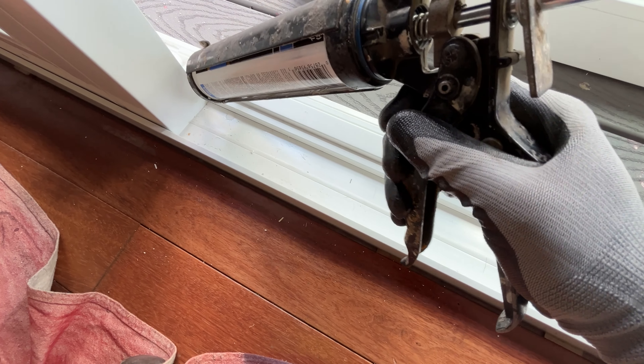There we go — that's it. Caulk the door and silicone the inside edge. Also make sure that the glazing — this replaceable piece — is on the inside, and you can tell by the groove. Next, install the stainless steel brackets top and bottom. You've got to pre-drill it, then install a pan screw into the window and another pan screw down. Caulk the holes. Before you put the inner lock cover on, note these nubs — see how they stick out past the window? We need to trim that off using an oscillating tool.